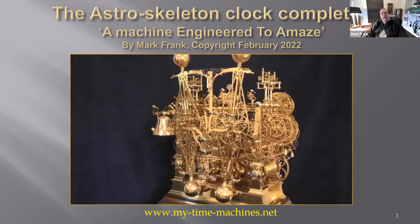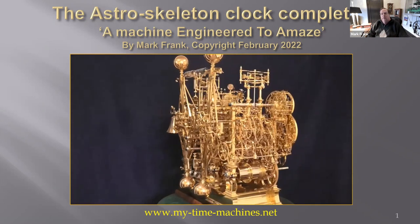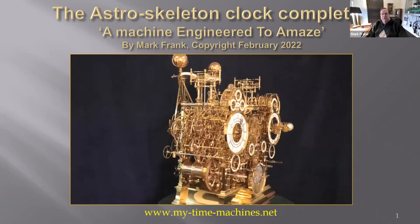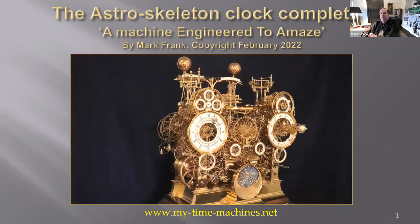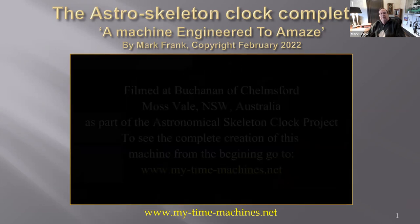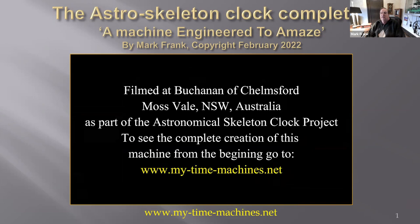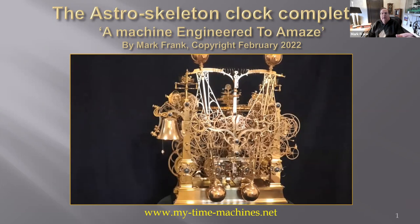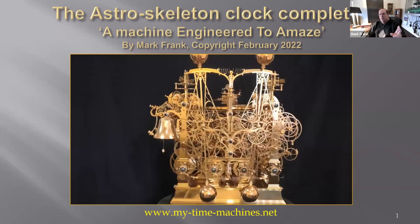The problem we're having now is that once in a while, because as you mentioned there are so many components, it just simply goes crazy. You'll go from an average of maybe 3 minutes or so a week to suddenly it'll speed up or slow down. And then after a while, it'll go back again to a fairly consistent rate. Clearly somewhere in the machine, we're encountering some kind of shift in the parts, either some kind of friction to make it run slower, or some other part moving in a way that's making it run faster. We're also discovering that these compound pendulums, to no surprise, are very sensitive to where you are moving the adjustment weights.